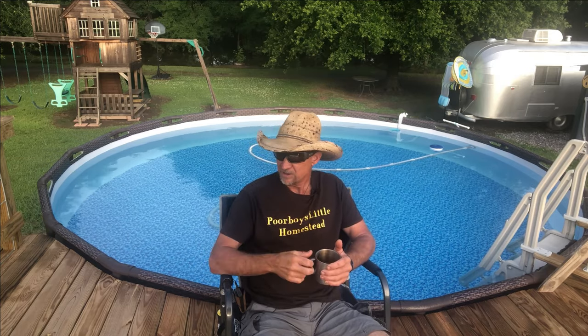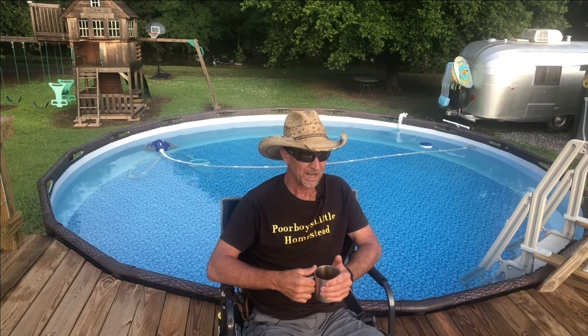Another question I've been getting: if you have your pump running on an extension cord, do you need to unplug it during the rain? I have extension cords out here running to my chicken pens, and yes, when it rains I unplug them. I don't want any electrical cord laying on the ground when it's raining. That's where you need that GFCI circuit breaker or adapter plug — that way, if you happen to not be home and it starts raining, odds are it's going to trip. That way, no kid or anyone can go out there, step in water around where the extension cord is laying, and get electrocuted.